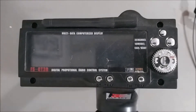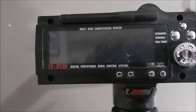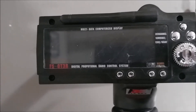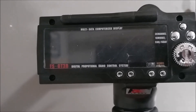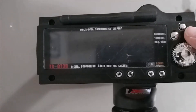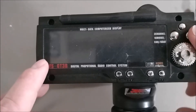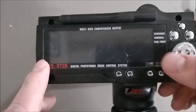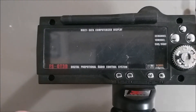Today I'm going to be making a video showing you how to connect an external radio module to a FlySky GT3B. Lots of my videos say they apply to the GT3B or the GT3C, but the external module can only be put on the GT3B due to it running off a 3S LiPo or 8 AAA batteries — basically 12 volts, which is usually what external modules need. The GT3C only runs on one LiPo, which is 4.2 volts, which isn't enough.